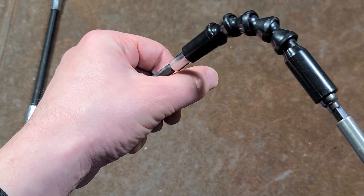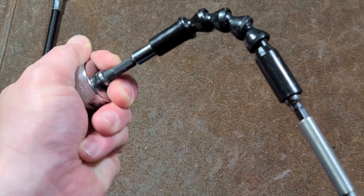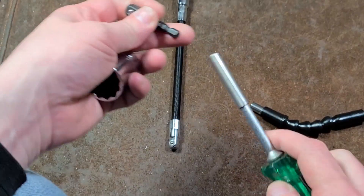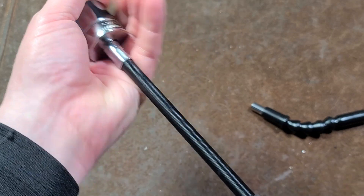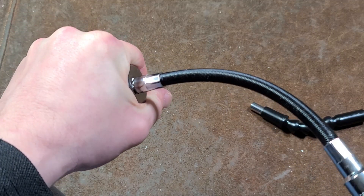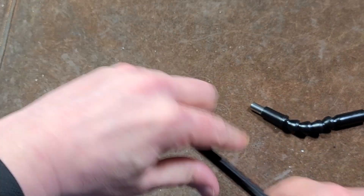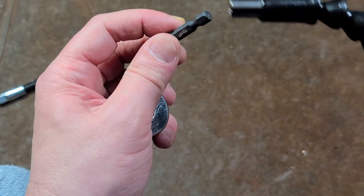So this is actually not for breaking screws unless they're not very tight — it would really be for running fasteners in and out of a tight space. I only spent five bucks on it; I wasn't expecting it to be super strong but I wasn't expecting it to feel quite this weak. If I compare that to this — this is a three-eighths, not a quarter inch version — something like this you really feel it. Even though it can only bend 30 degrees, you feel much more connected. I can put a whole lot more force on that. You can see how it's stretching my skin, how tight I'm holding this — and if I held this thing with the same amount of force I would snap it without question. This thing would just immediately fail.